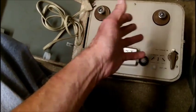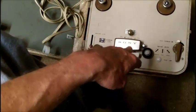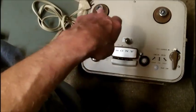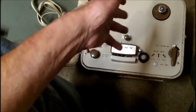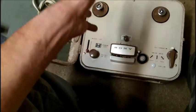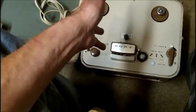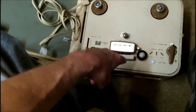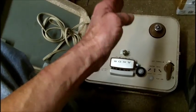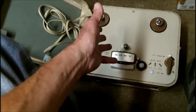I'm getting a lecture on aligning the heads with the azimuth. You know how I did it? I use a pre-recorded music tape. I'd put it on there and adjust the azimuth and the head alignment. I've done it for years — I never go out and buy test tapes. You don't need that. For speed you need a constant tone, but I never got fussy with it. If it sounded good, I left it.